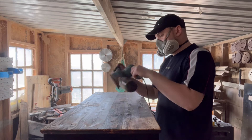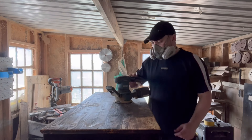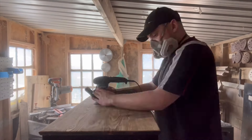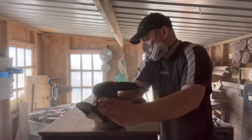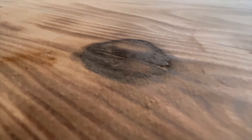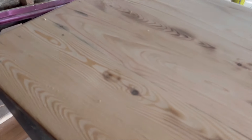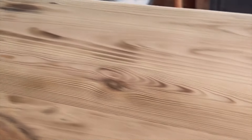I re-finished the table and at this point I thought my sander was broken, but I remembered I didn't plug it in at the wall. I sanded it all the way back down — it burnt like three or four millimetres into the table so this took absolutely forever to sand. Obviously I had the legs on already so I couldn't just run it back through the planer, and it's too wide anyway, so I just had to sit there for probably two hours just sanding with 40 grit trying to get it down. You can actually see the wood starting to come back and look like actual wood again instead of burnt wood. I was so worried I was going to have to scrap this table but I just kept sanding and it started looking better. We're all the way back to pure wood now, so it needs to be re-burned and re-finished — the whole shabam.